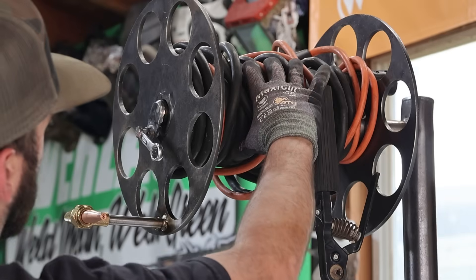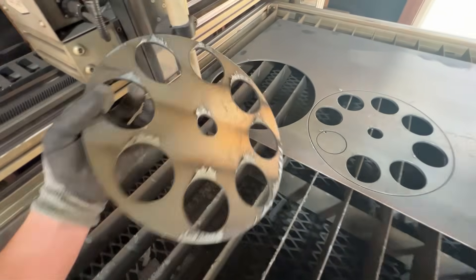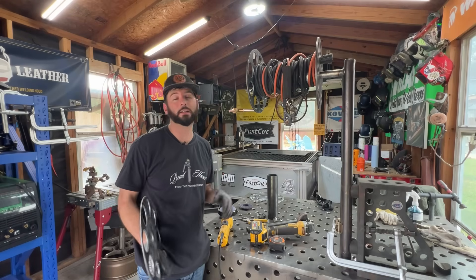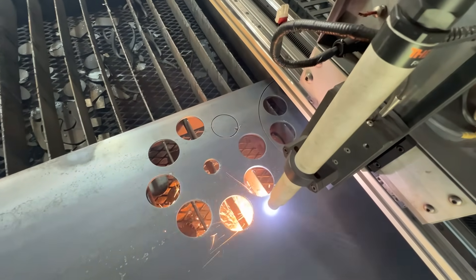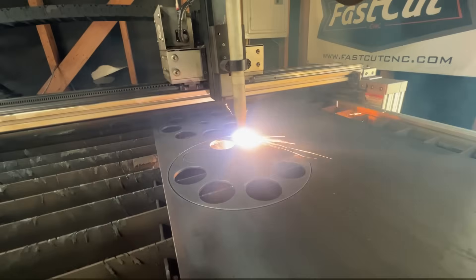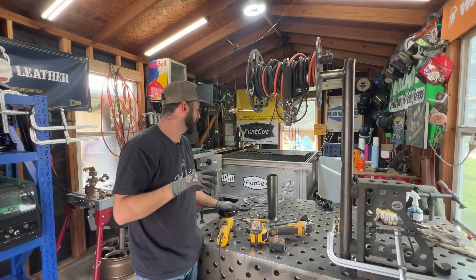We basically have a barrel system on the inside with two bearings, and then we're going to block off the ends with our end plates. You can cut them however you choose — by hand, laid out. As long as you lay them out good and have some good grinding and cleaning techniques, you can get a nice circle. But I went ahead and cut them on my FastCut CNC table along with the Thermacut extra fire, running at 65 amps and a hundred-and-something inches per minute. Saves me a lot of time. The total for four plates comes out to what I've got written down over here.